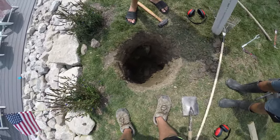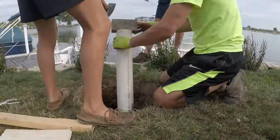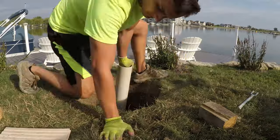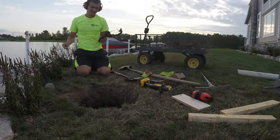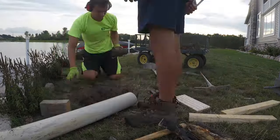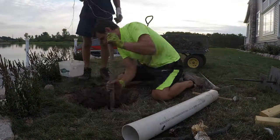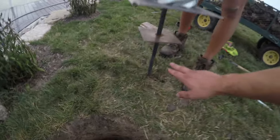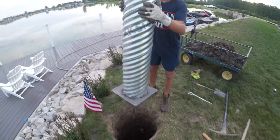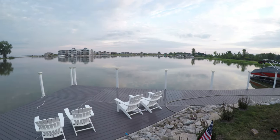The results are pretty good and we're gonna keep widening it with the PVC pipe. We still have an issue with some of the stumps that are in the way, but hopefully we'll just be able to get those out with an axe. It's the evening now and we just finished digging the hole. It's approximately 46 inches deep — that's quite the dig. That will take the ground sleeve right about a quarter of the way down the lightning spike, so it should be nice and set in there. Should have no issues with movement once we put the concrete in. It's getting kind of late, so tomorrow morning we're gonna put in the concrete.